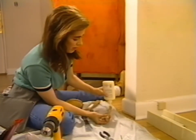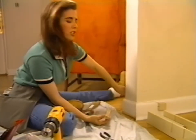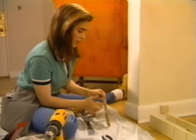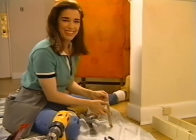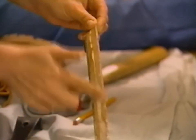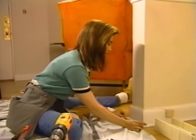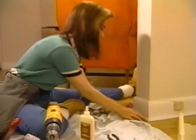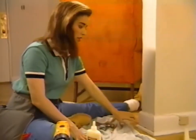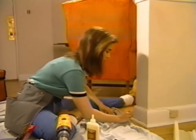I'm just going to run a little thin line of carpenter's glue, which is just like white glue, only yellow, and it's stronger. I just get right in there with my fingers — I just don't seem to care — and then I'll just wipe it on my pants, because that's the kind of carpenter I am. So there we have two sides glued, and in it goes. The glue squirts out a little bit. I'm going to nail this piece in place first, then I'll wipe up the excess glue.